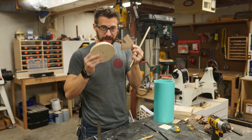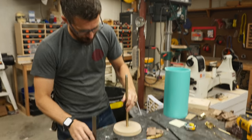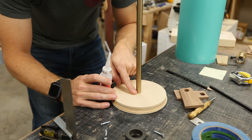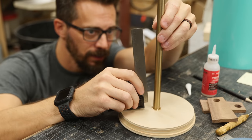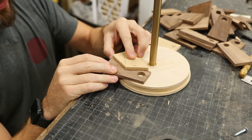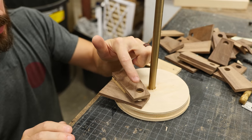I think we've got all of our different pieces ready now, so we're going to start assembling this and hopefully put it in the form and start pouring some epoxy. The first thing is to put this post in here, but I noticed once I stuck it in that it actually isn't perpendicular to this base - that would mean the entire lamp would be skewed. So we have to make sure this is square to the base, which means I'm probably going to have to use some super glue to hold it in that position. All of the steps are going to drop down over this, and we made a little spacer with a ledge on one side so it can sit right up against the outside edge - that tells us where the next one goes. We'll drop the next one down on top, and we're going to use a little bit of glue on these to hold them in place. Eventually the epoxy will just sandwich everything together.